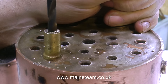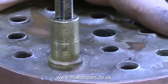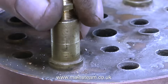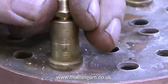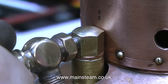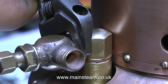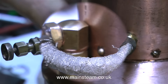It's me drilling a hole in the top bush. The top bush is just no good at all, threaded ¼ inch by 32 threads. So I've drilled out the bush and I'm now threading it 5/16ths by 32, which allows for much more volume of steam to escape via the tap to the steam engine. I made a simple hexagon right-angle fitting and I'm now screwing the tap into this. This makes for a very strong arrangement, and the tap is at right angles to the boiler instead of being perilously close to the hot part, which is the centre cap.